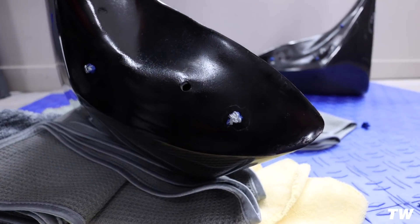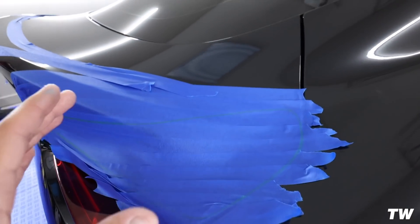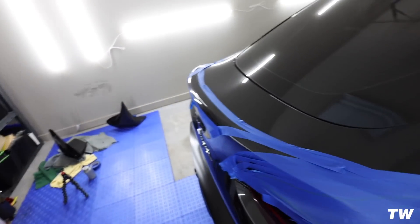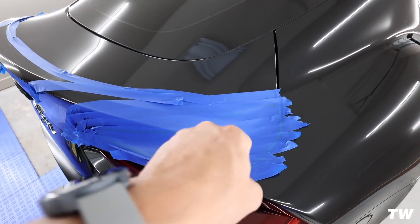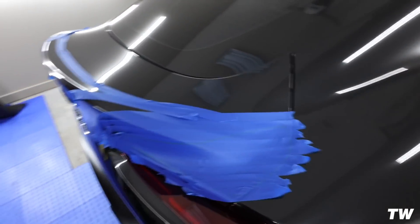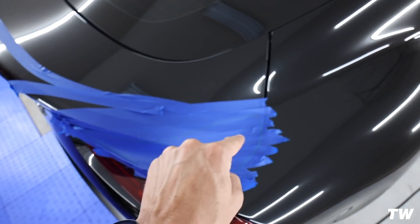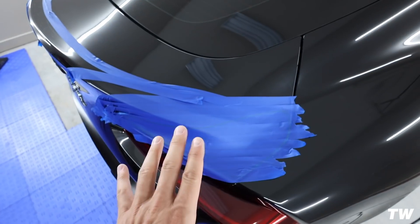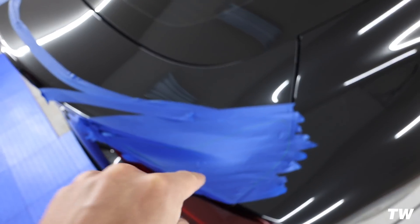A little bit of anti-seize lubricant on the paper. That's why you draw the outline - because you want a guide to put it on rather than just putting it on and smearing your lubricant everywhere. When we drill the actual holes we're going to start with a smaller bit, then use a larger bit, and then from the other side use an expanding bit to open up that plastic. We want to make sure that when we first pilot through, we don't go all the way - just pilot the first little hole.